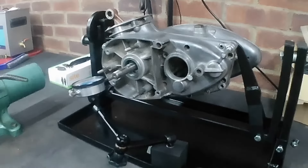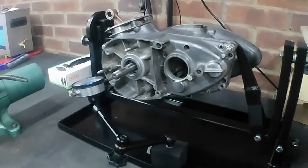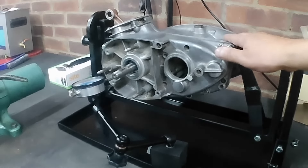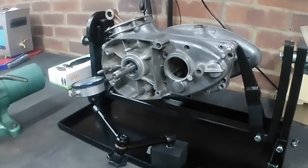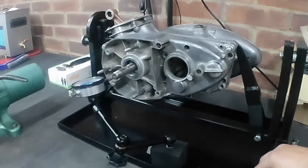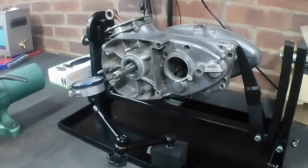Back on the tripod on the floor so you can see what's going on. We've measured up twelve thousandths. We want four to six thousandths as our target — to hit four we would want an eight thousandths shim. I've been through all my shims and I've got quite a sizable collection, but I haven't got eight thousandths and I can't make a combination to give eight either. I can make six, I can make various other numbers. I've even got an eighteen thousandths — I don't know what you'd need to be doing to fit one of those!